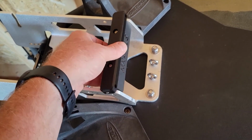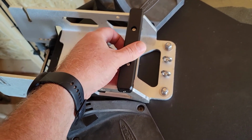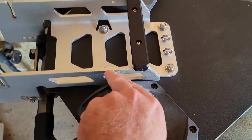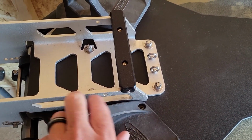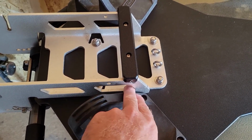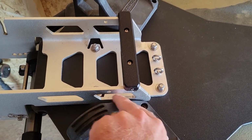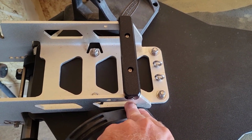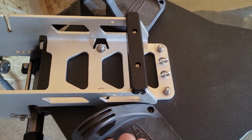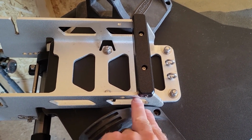Then you move on to the motor bracket cable clamp. On the Newport NK180S bracket, I like to install it back to these back holes back here. The Torpedo doesn't have these holes, so a lot of guys will just install and clamp it in place. Theirs goes down a little bit this way, and they'll install it down near the end and just clamp it in place with the screw and a washer. Some guys have drilled holes through their bracket and installed it that way as well.